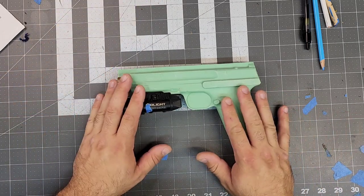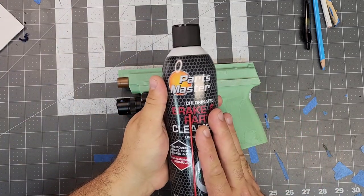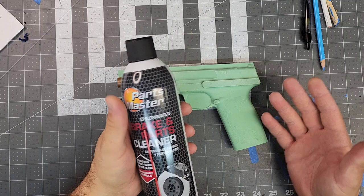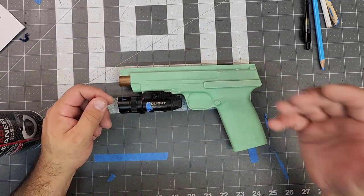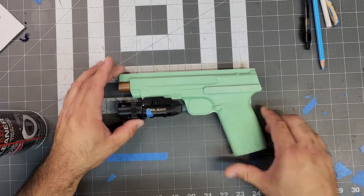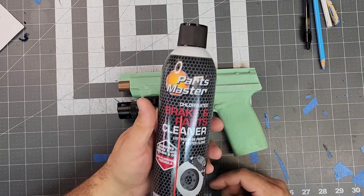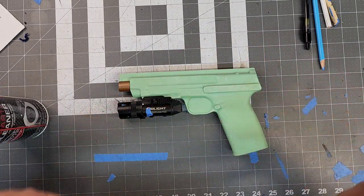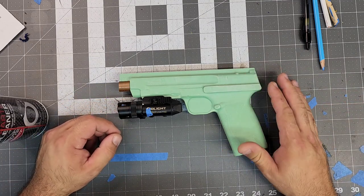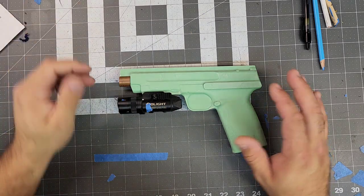I have already cleaned this. This is a brand-new mold from Multimolds — Tony and his team over there. I've already cleaned it with parts cleaner. If you notice that when you get this stuff, it is extremely slippery and it's got a film on it. That is the mold release from when they make the mold and their setup and their process. So a little bit of parts cleaner — I spray it a whole bunch of times, and then I blow it off so we don't have to worry about it. You could also bake it or use soap and water after the fact.